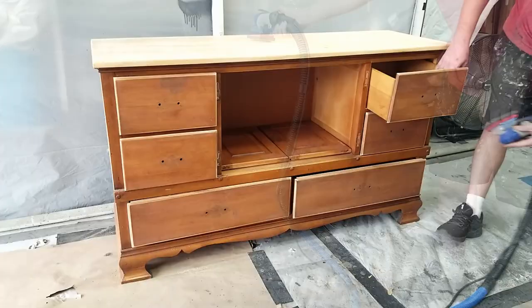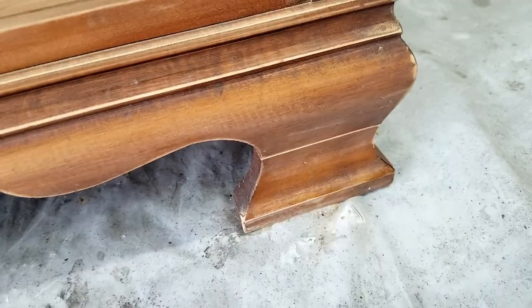When I was sanding the leg of this piece the vibration actually loosened up this leg, revealing to me that there was some damage that I needed to take care of. This may have been overlooked if I skipped the sanding step, and while it is going to create more work now, at least it isn't going to fall apart whenever the customer has it later on. This is actually a relatively easy repair — all it needs is to be taken apart, add a little wood glue, clamp it, and give it a little bit of time to dry.